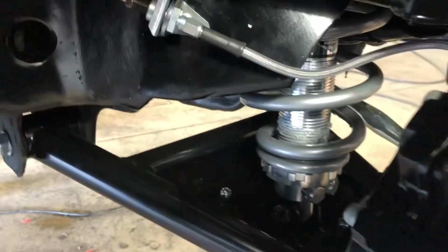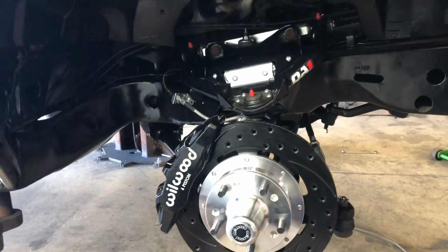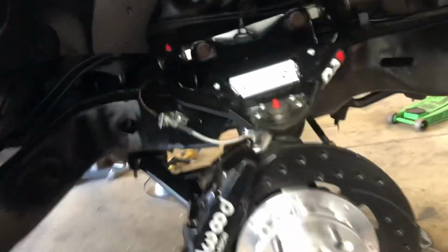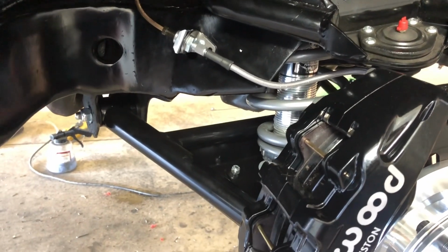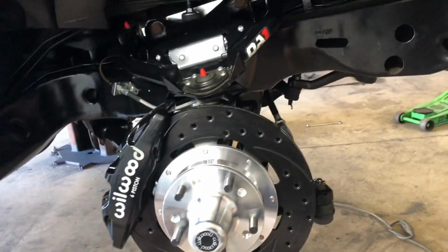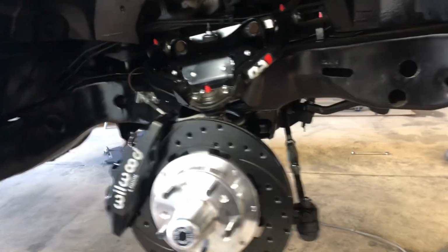But yeah, so this car only went with a 350 spring because of the V6. I do believe Kevin says he's gonna go with an LS motor. I think he already has one. So somebody will be putting that in, and then, you know, it's got aluminum heads, aluminum blocks, stuff like that. Even if it's a cast block, whatever, there's gonna be plenty of room to twist it up. Worst comes to worst if we gotta change it from the 350 spring to a 400 or something like that. But I'm pretty sure it's only 24, so it'll sit right where we want it to sit.